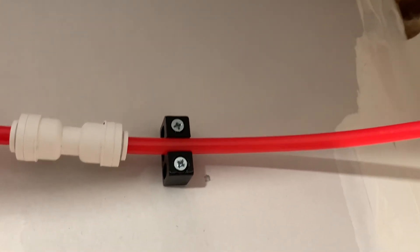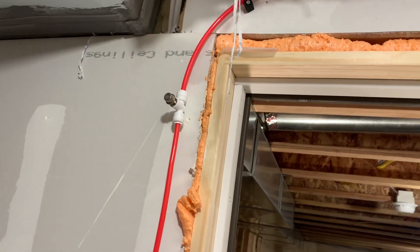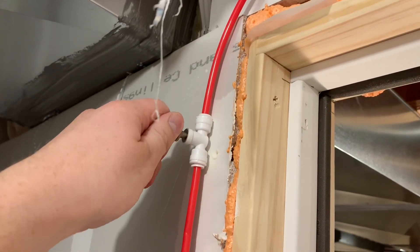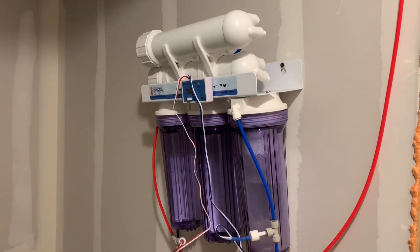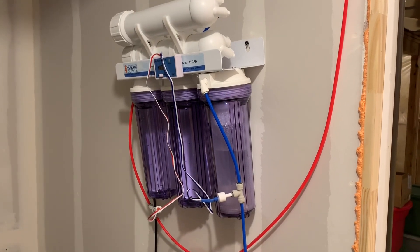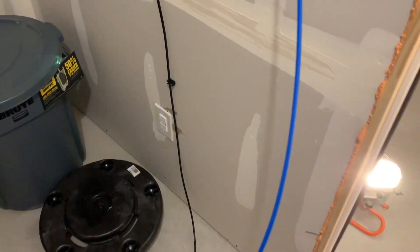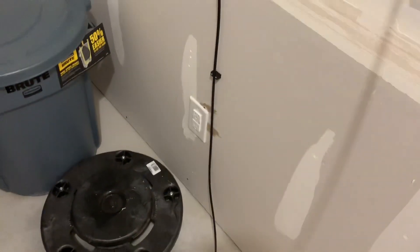I found these nifty RO holders that allowed me to really clean up the RO tubing. There are very small screws — it is screwed right to the drywall. The RO line clips in and I ran it up and around the door frame just to keep it out of the way. I did put a needle valve before the actual RO unit as a second redundancy — if the main ball valve on the three-way connection ever failed, I can use that to shut off the water source as well. I'm showcasing my RO unit quickly; we'll go over that in the next video. I kept it color coordinated and used a lot of these RO clips to keep it very clean and simple.